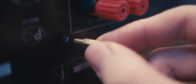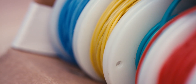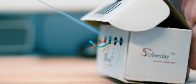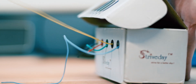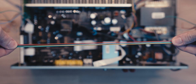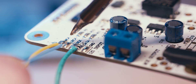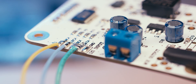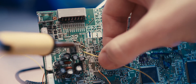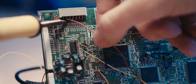We definitely do not want any metal shavings floating around in here, so I've turned the unit upside down for drilling. It's time to measure out four lengths of wire to reach between the WM8804 and the I2S pads on the input board — leave a generous amount of slack, but try to ensure each wire is a different color, otherwise this is going to get confusing very quickly. Strip a couple of millimeters from the end of each wire and solder them between the I2S pads and the 8804. The usual conventions are: green for data, yellow for master clock, blue for BICK, orange for left-right clock, red for 5V, and black for D-ground.